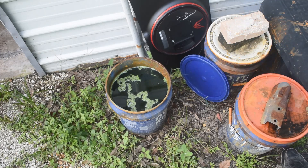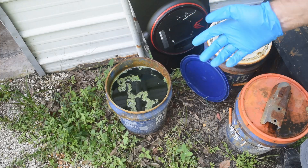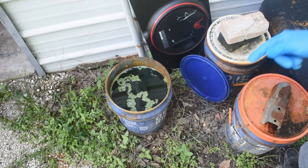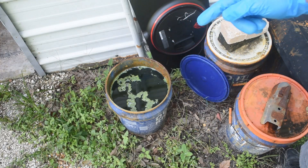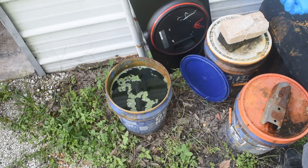We've got a lot of deep green liquid in this bucket. This is the waste from my IC chip de-legging process, where I dissolve the legs off of IC chips before I process them to recover the gold and silver. There's a lot of iron in this bucket because the legs have a lot of steel in them, a lot of copper because the legs have copper, and there's some tin in here too.